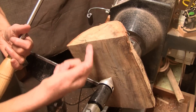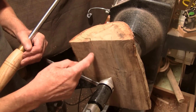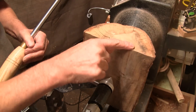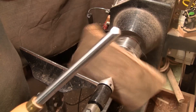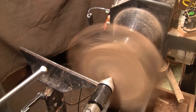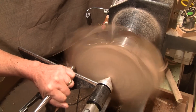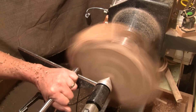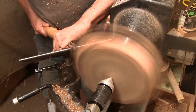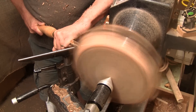I just sharpened my 5/8 bowl gouge. I'm going to do a little cutting from here and then move up and cut down into the bark instead of under it. The reason I'm going to do that is I have a crack here that comes around right there. I want to see if I can cut that away — it'll just make the piece stronger if I can get rid of that crack. Doing about 700 RPM. So I can cut that out.